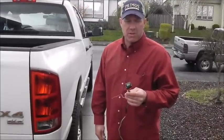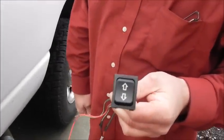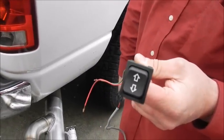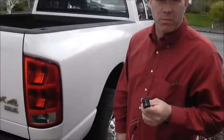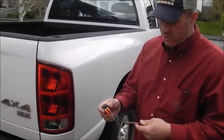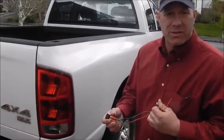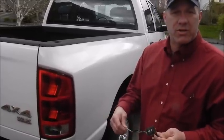This switch is a double-pole, double-throw switch that I bought off of the same website as the actuator — DC Actuators. There are schematics online to show you how to wire a double-pole, double-throw switch, crossing over the terminals so that you can run two power wires into it — power and ground in — and then two wires to your actuator.